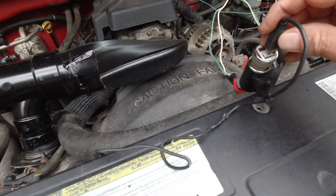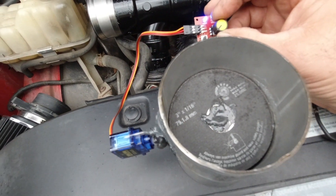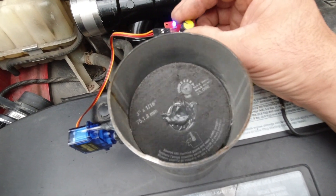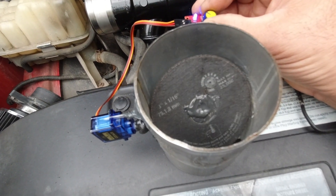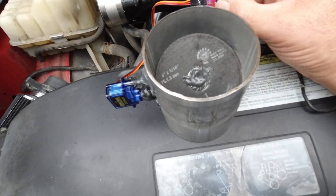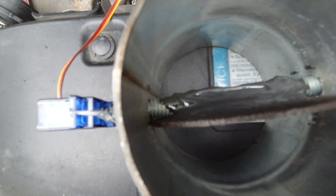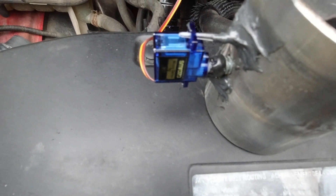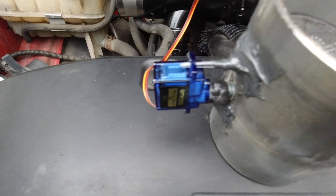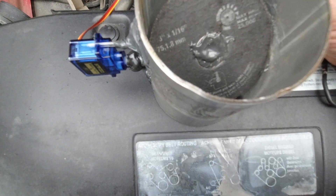When you plug it back in, I have it hooked to a servo tester here, and when you turn the knob it responds pretty quickly — it does the job opening and closing, and anything in between. You just turn the little knob and it does what you tell it. When you code it into the Arduino, instead of having the code say zero to 180 I can have it go zero to about 85, so it will work a little smoother.